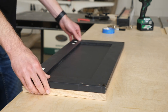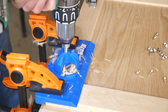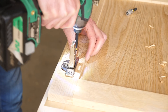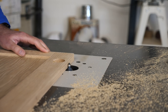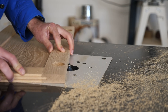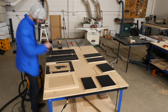I was looking for an easy way to transfer the hinge location from my old doors to the new ones. The best idea I had was to clamp them together, align them as best I could, and then drill through the center marks left by the Forstner bit to make a pilot hole where the new cups could go. To mark my door handles, I just set it where I want it, hold it there, and use the self-centering bit to drill out some screw holes. I had noticed the old doors and drawers had a little chamfer that went all the way around the perimeter - you could definitely just use sandpaper to break the corners, but I figured since I'd come so far, I'd go ahead and keep matching the old look.